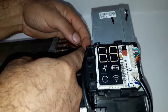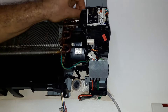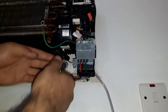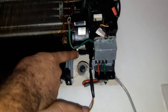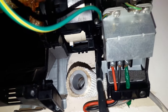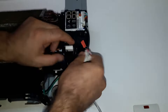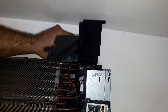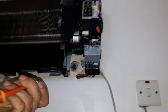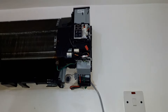I have already lubricated the sensor to prevent corrosion. Now I am reconnecting the blower circuit's connectors. There is a little hook that holds the wires. Also there is a space for the wires — we should secure them there.